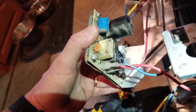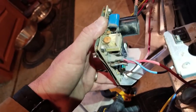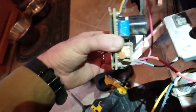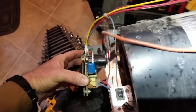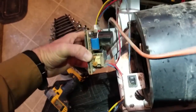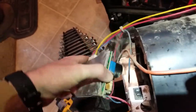I got the motor to work, and all I did was move this control board. So what that's telling me is there's a wiring fault somewhere on this. When it was in this orientation, you hear that clicking sound? So there's a short somewhere — it might be on the board. By moving this around, I'm getting it to work and not work. Okay, it stopped working.